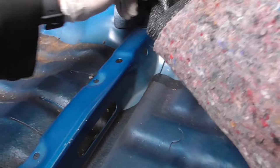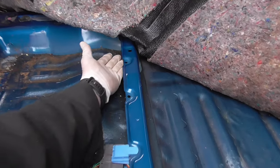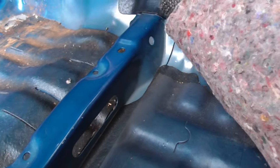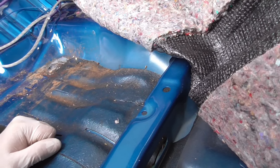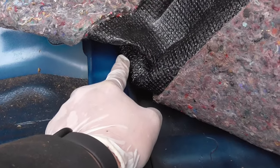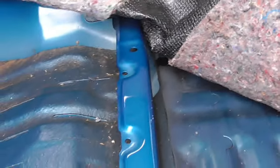However, for the inside, it's just a hole — there's nothing on the back side. So you're either going to have to get a wrench back there and bolt it down, or what I'm going to try to do: I have some big nutserts — I think I have a three-eighths nutsert that might fit in that hole. If I've got a nutsert, I might just nutsert it in and I'm going to have three solid mounting points. But if not, you can put a nut and a bolt in there for the back side, put some nice hot tack welds, and then bolt it from the front side.